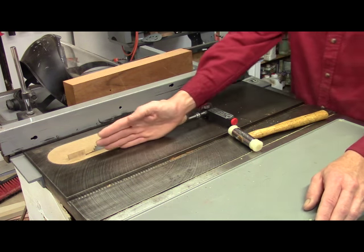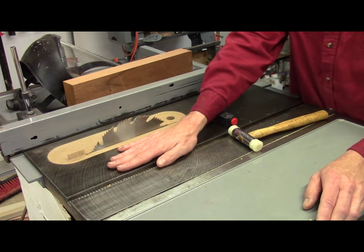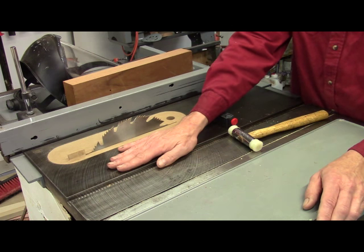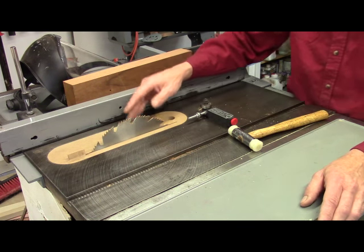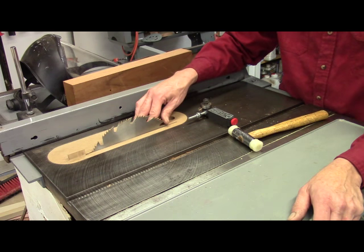The ideal is to have the piece come off the off-side of the blade so that when it falls, it can fall free, presents no kickback hazard, and is not marred in any way. But that requires you to reset the fence for every cut — and how do you do that with consistency and accuracy? You really couldn't measure it every time and get enough consistency; it would have a fairly wide range of thicknesses.